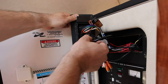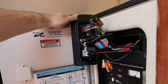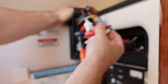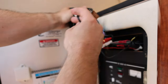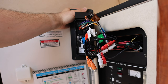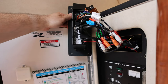This next one is the USB cable, and that's for adding an extra USB port for plugging in a phone or another USB device — I'll show you where I've got that mounted after we get through all these cables. Next, let me fish it out so you can see it — this is your subwoofer cable, your aux input cable, and zone one and zone two cables. I'm really only using the aux input cable. That would be like if you had something with a headphone output jack and wanted to pass audio from it into the radio.